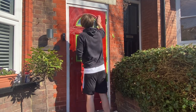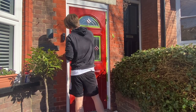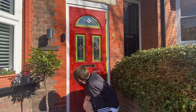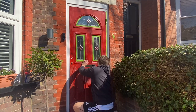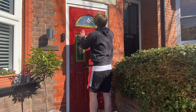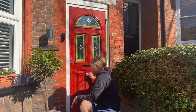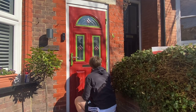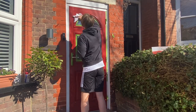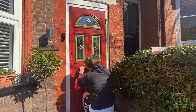This is to make adhesion of paint so much easier and to make your finish a whole lot better. Once you've given the door a good sand and it's all nice and even, you need to clean down the door. I didn't clean down the door before I started sanding because I thought it was kind of pointless. Really you just want to give it a good clean all the way over — get rid of all the residue from the sanding and all the crud that generates over time, to give yourself a nice clean surface to work on. Go over it maybe twice, clean it down with a lint-free cloth to get rid of any sugar soap residue or whatever cleaner you're using, as that may affect the finish of the paint. Make sure it's all cleaned off and dry before you start painting.